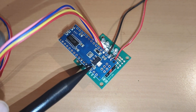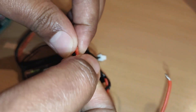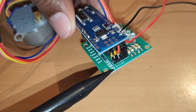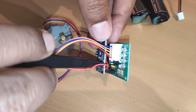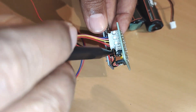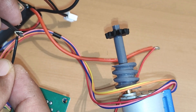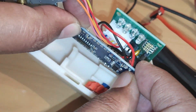The voltage range of this Arduino Nano board is 7V to 12V, so we shall be using two 3.7V batteries connected in series — it's showing 7.13 volts, which is okay. The voltage range of the motor control board is 5V to 12V. The red wire connected here is 5V output — we have given the 5V output from the Arduino Nano board to this controller board, and the ground from this point. Now let's check — the worm gear rotates in an anticlockwise direction.